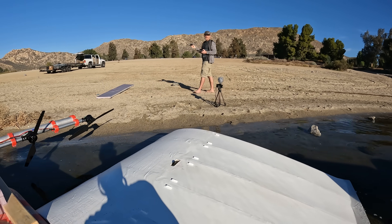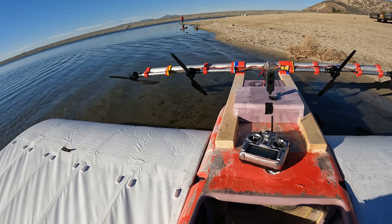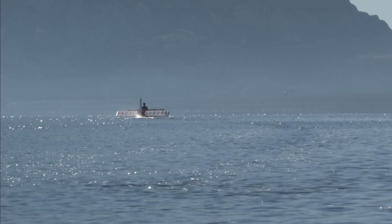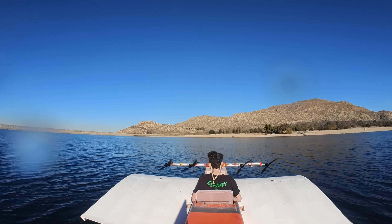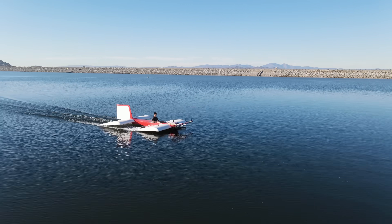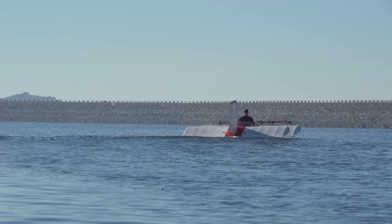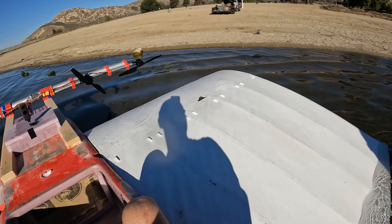Could you see if I was actually airborne? Yeah, I think the step was still hitting. So we weren't actually flying. Daniel drove the craft one more time — you could definitely tell the ground effect was working as the wing stayed perfectly flat and out of the water, but unfortunately there just wasn't enough speed to get the step off the water with Daniel in it. My additional 55 pounds was enough to take this from being the world's coolest boat to the world's lamest boat.